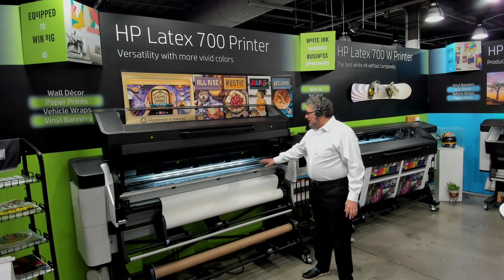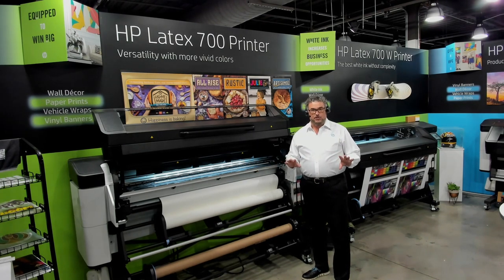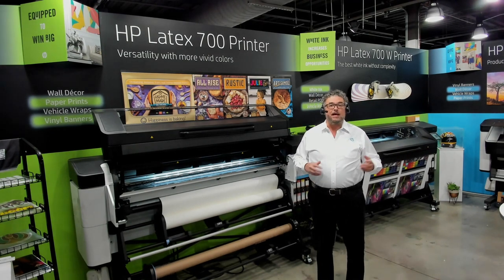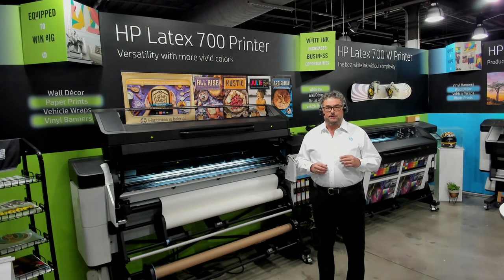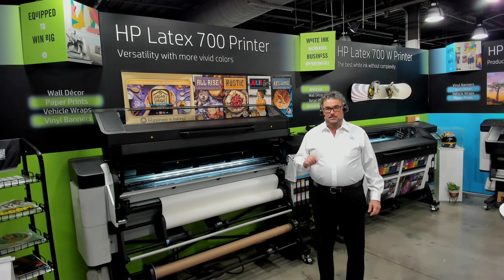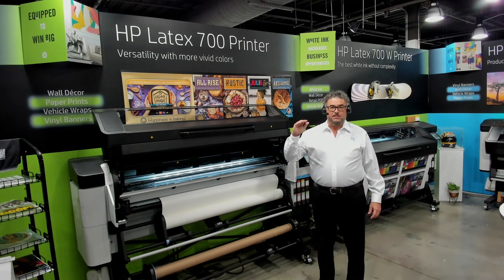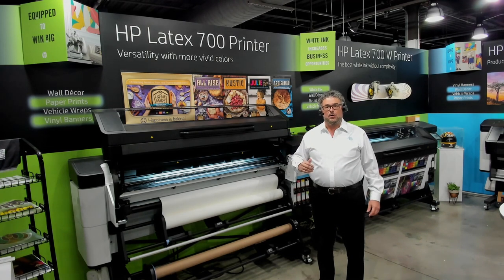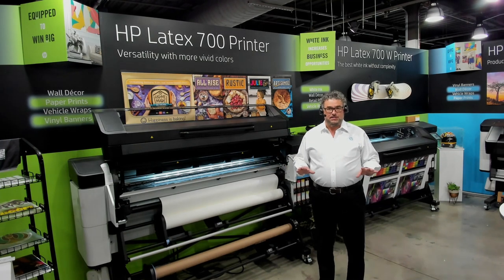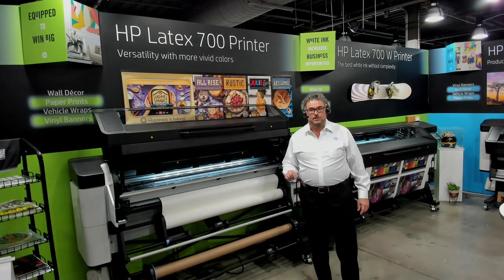What we know is that if we can get this print zone to have a very consistent temperature for everything that runs through at all times, and then also with the improvements and modifications we've made with our print head, the control of the energy in the print heads, we want to have strict control over everything in the printer and everything through the print zone so that you always get color consistency. For example, if you're doing tiling with a 12-pass mode, we will specify under 1 delta E consistently doing a color calibration. We want you to print the same color at the beginning of a roll, the middle of a roll, the end of a roll, and then even a week later when you load it in, do a closed loop color calibration, dials it back in, you print consistent again. Having this homogeneous print zone is a big key to that.